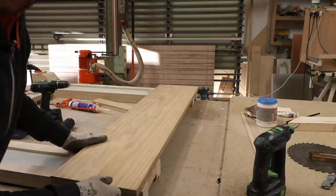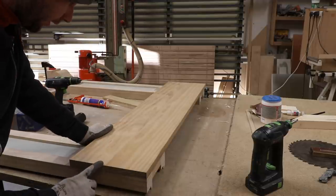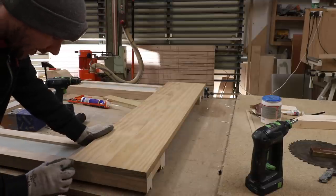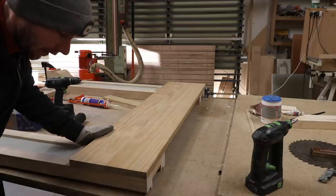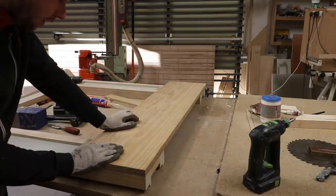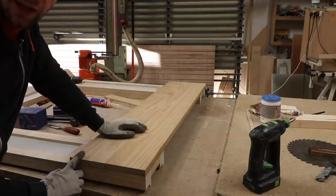Okay, so the last bit after the mantelpiece top is there's like a skirting board. I'll call it a skirting board, it's more like a plinth block. But I'm just going to run a bead detail around the top and leave the rest of it nice and plain. Then the skirting board will come into it and finish into it. So this is about 295 tall, and the skirting board's about 220, so it'll give a nice sort of plinth block height to match the rest